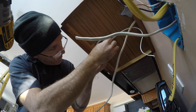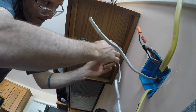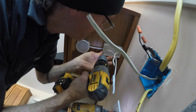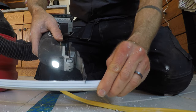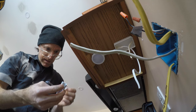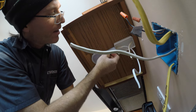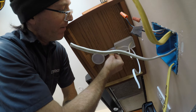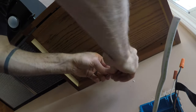What you're doing here is tying a lamp into your wiring, because the LED is technically a lamp and it has a lamp wire. So the lamp wire runs into the junction box, which is screwed to the bottom of the cabinet. Then I cut some surface-mount conduit — plastic conduit. I just like the way it looks. It comes out pretty clean and it has a snap-on face and adhesive backing. Once you peel that adhesive backing, you can stick it up under your wire and click on the face. All that's left is to tidy up your wires, cut them to the right length, make your connections, and store the connections inside that little improvised junction box.